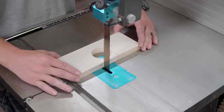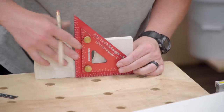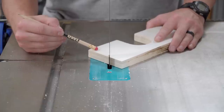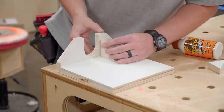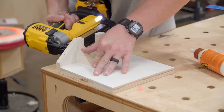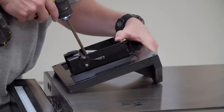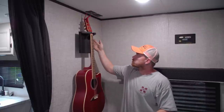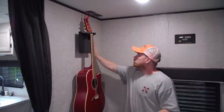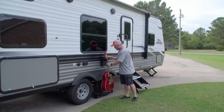A two inch slot will be perfect for my guitar, so I start by making a two inch hole in the smaller rectangle. Two cuts at the bandsaw turn the hole into a rounded slot, and a little file work blends the hole and bandsaw cuts. To provide more support and make the holder less bulky looking, I draw a 45 degree line one inch away from the slot on either side, then cut off the 90 degree corners at the bandsaw. Glue and pin nails secure the two larger pieces, then more glue and pin nails add the corner off-cut pieces to help brace the top. Hand sanding, black ink, and a clear coat finish it off. It holds the guitar just as expected, though I'll likely add a bungee to keep it in place while traveling. One really cool aspect of the key block system is you can have a few located in different spots to move stuff around — this camper even came with one already mounted outside.